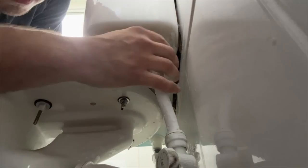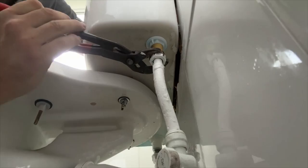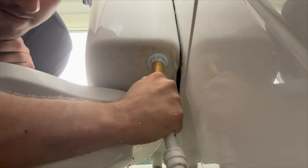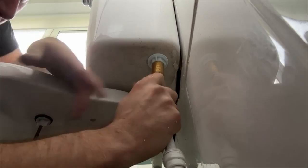On here, we did have a little bit of a leak, and for the life of me, could I get it to seal? So, we ended up ripping it out again and starting again. Some of you are going to moan at this, but the customer's happy with it and it worked. I used a bit of plastic pipe with a speed fit tap connector. It looked smart. The customer wanted the plastic thumb turn isolation valve, so it worked well with what we had there.